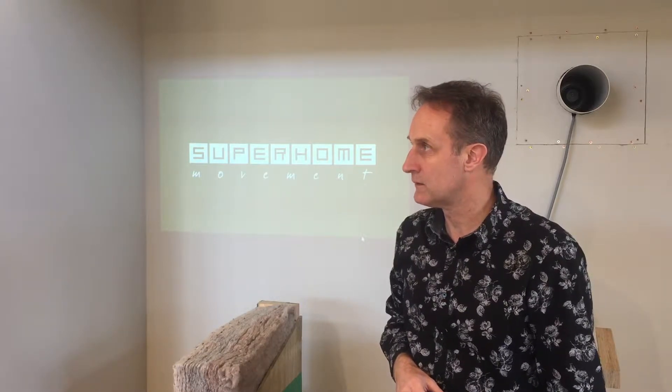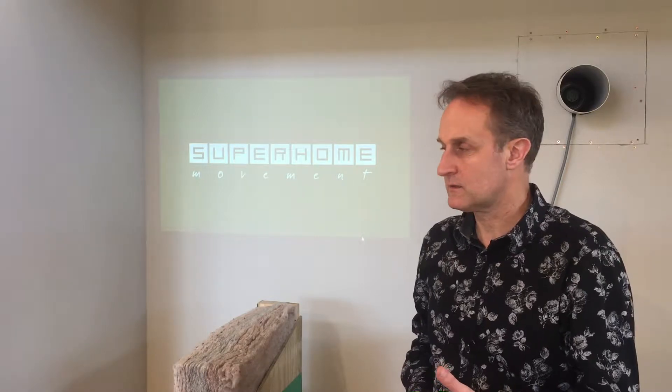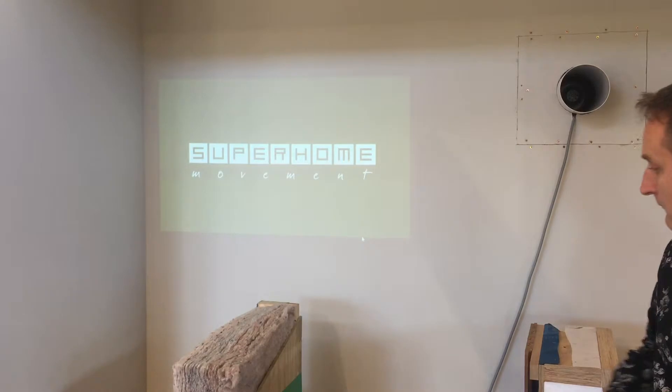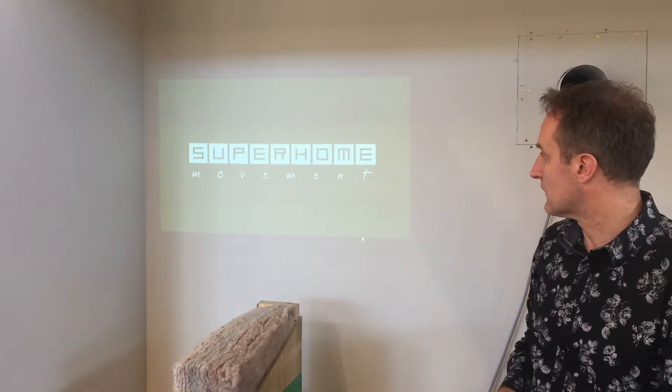So that's the ventilation, the wall, and the windows. Here we've used new PVC window frames and we've recessed the windows — it's standard practice overseas to have recessed windows, but it's pretty much not done here. About 99% of windows in New Zealand are mounted flush, overlapping the cladding, so they're in the cold ventilation cavity on the outside. There's a lot of thermal bridging that happens there.